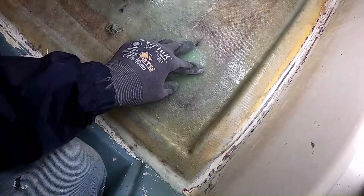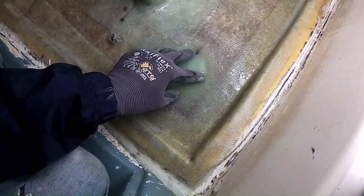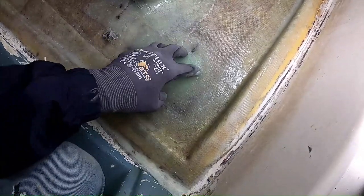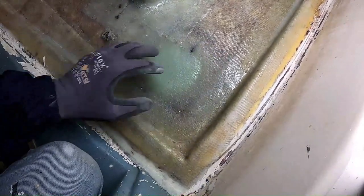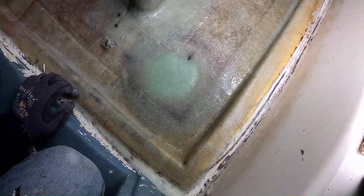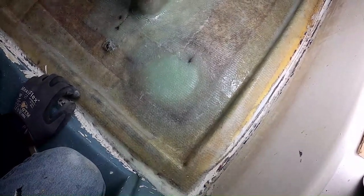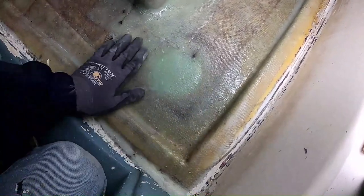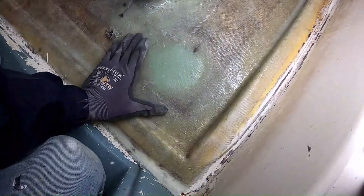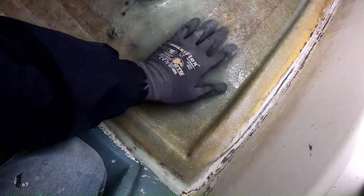And then in the center of this, there was uncured resin, for sure. It was just wild. It was like a mound here, you know? They didn't even really attempt to taper it. They just cut it and built up glass all in this area. And I guess they sealed it and it worked out okay. But I was not okay having that on this boat. So I went ahead and cleared that out, as seen in a previous video. Tapered it out to a bevel about 12 to 1. I did larger on the back side actually. But anyway, it's been tapered,